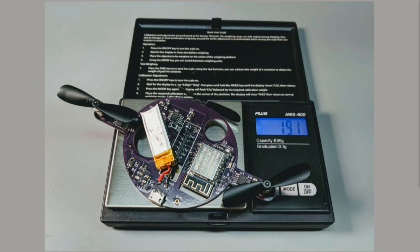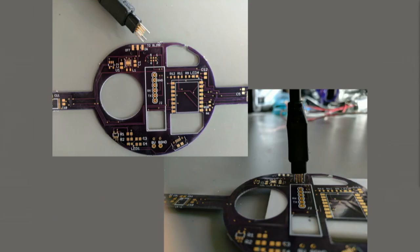Okay, so I see only 3, so I'll tell you what a tag connect is, because it really changed my life. Tag connect is that little cable, it's got a programming end and pogo pins, so it pushes against your footprint, which is the size of an 0805, and programs your chips. You don't need to solder in a header, you don't need to buy a header.